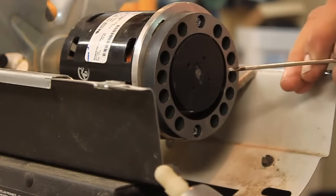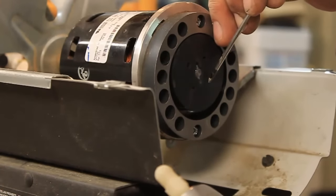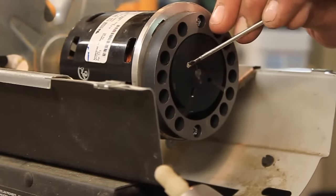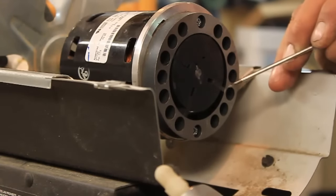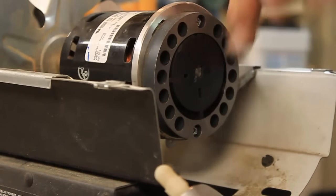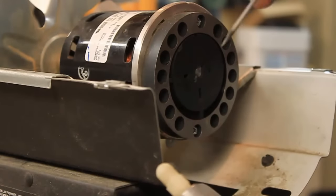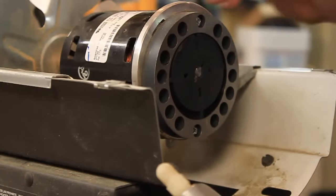Here's what's wrong with it. You see these parts right here — this is supposed to come down like a blade from centrifugal force and pump the air. It's supposed to drop and push air into these holes right here. And that suction, just like a spray gun, will pull kerosene through into the igniter and give you heat.